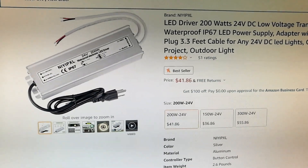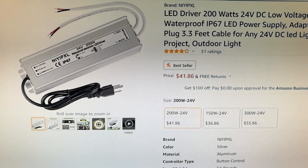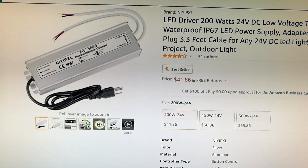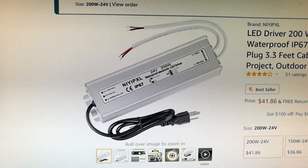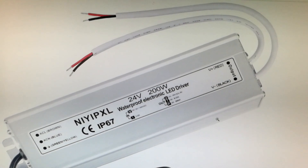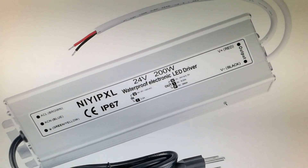This is the adapter that you will need. It's a LED driver, 200 watts, 24-volt adapter. As you can see, that's $41.86 plus tax, which ends up being close to $48 for both parts after tax — that's a third of what Fanatec wants for their stuff. Here is the image, and I will show this on my kit afterwards. I just want to show the parts first and the listing so you can buy the exact things you need. It's 24-volt, 200 watts, waterproof, and all aluminum, so it dissipates heat very quickly. It's perfect.